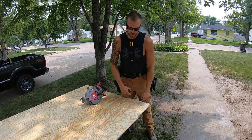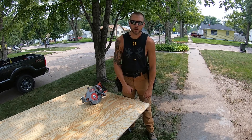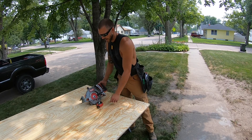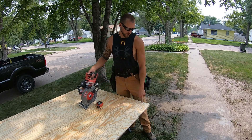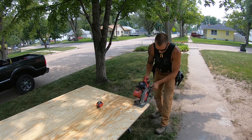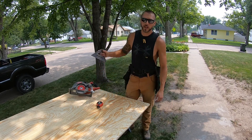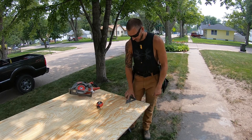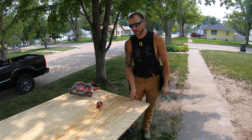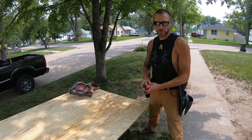Like framing or sheeting a gable or something — you can take your saw blade, if you don't have a clip or anybody there to hold it for you, scribe out your line a little ways and make a saw kerf right on your line. Then you can drop your string line in there. If you were doing a gable or whatever, you could set your angle to whatever degree, scribe it, and make a saw kerf.